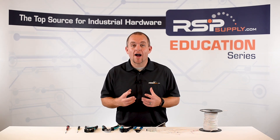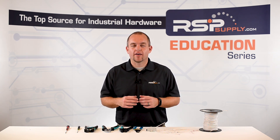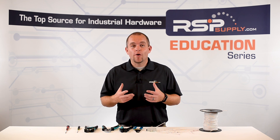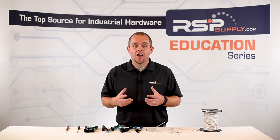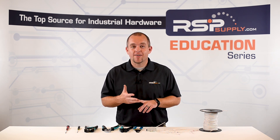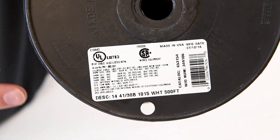The last thing we're going to talk about today is the wire that we're actually using and purchasing for our projects. Wire quality is essential for good quality and consistent work. We need to make sure that the wire we are using meets either the NEC or UL standards. When we purchase wire that does not meet these standards, we run the risk of purchasing imitation wire, which in many cases uses other types of metals that are less conductive and less expensive, causing conductivity issues and wire degradation over time. So when purchasing your wire, always check to make sure that you see either an NEC or UL stamp on the wire spool.